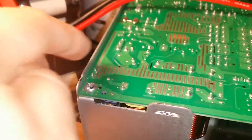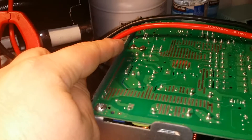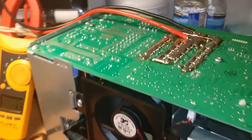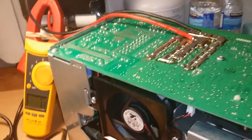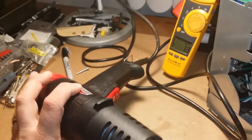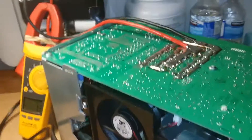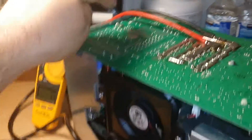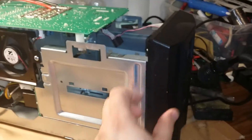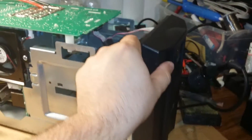As you can see, everything's at room temp. I haven't touched the shunt yet, but this little shunt I added across the stock shunt has enabled me to run a higher output. Right now the setup has about a 1200-watt limit, so when I run this heat gun it's pretty much at the limit of what this shunt will enable, even though in reality the system is running over spec.